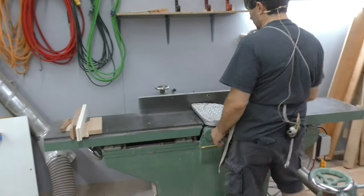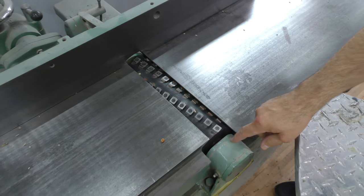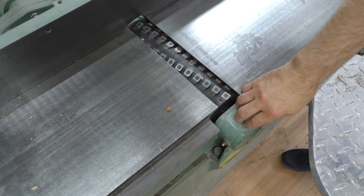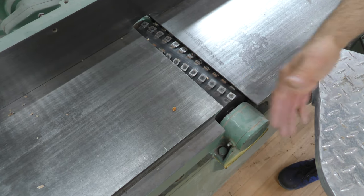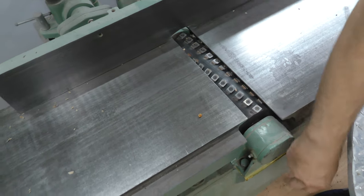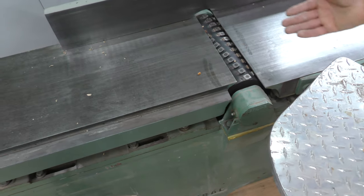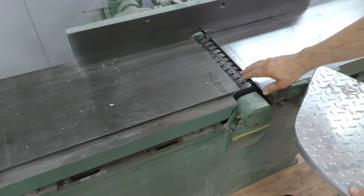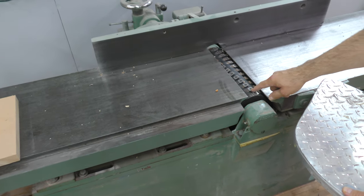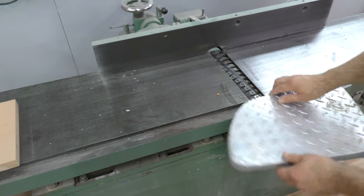This is my General 12-inch and I put the segmented head in here. It wasn't difficult — you had to take the blocks that hold the bearings out, pull it off, put the bearings onto the new head, and install it. I had to shim this one because, unlike the original which had straight knives you would simply make parallel to the infeed or outfeed table, this one you have to make sure the top of the cutting circle is parallel to the outfeed table — and that's why the shims.